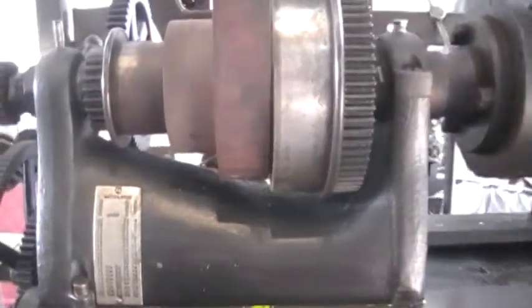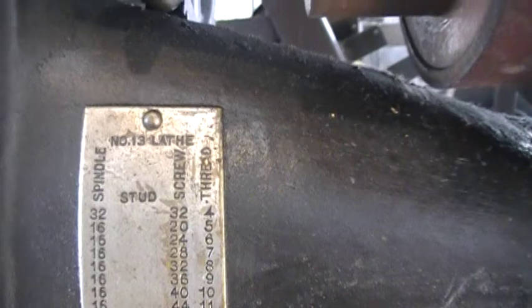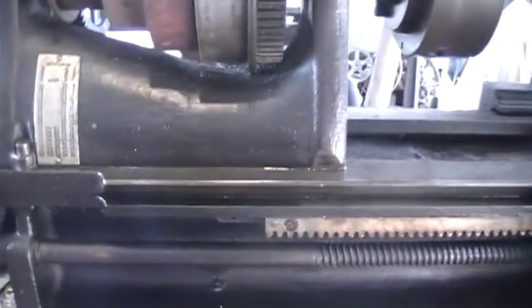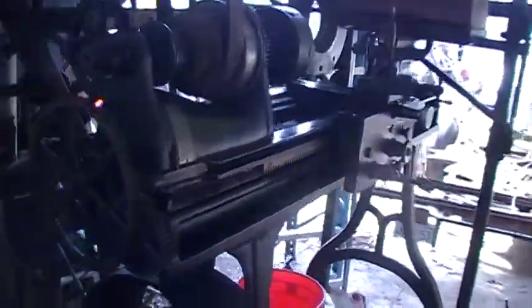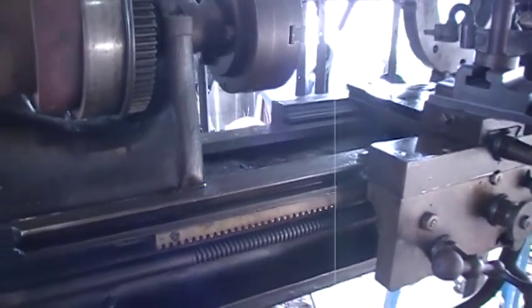The '96 does not have gear covers. And because I replaced the WP Davis lathe with this WFJ Barnes number 6 — it says number 13 right there, the thread tag says number 13 lathe — I don't know if this was a transitional piece. But I like the way they did the ways: the ways are underneath, not on top. That was apparently an early way to do it that didn't carry over to more modern lathes, but it's a pretty cool way of doing it.